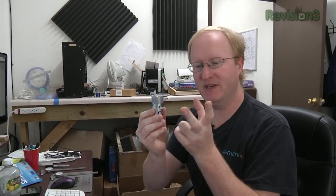So we have one of these gear motors left over. I always buy them in pairs at surplus stores. We used the other one on the camping episode for the solar-powered rotisserie. Anyway, I'm just going to double check the drawings I already have of this motor, make sure it's okay, and then I can use it to design the gearing for the flower pot. There'll be a big gear under the pot and a smaller gear here, so it reduces the speed and increases torque, because we don't have to rotate it fast, but the pot's kind of heavy, so we're going to need torque to rotate it at all.